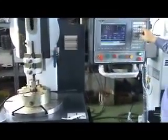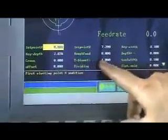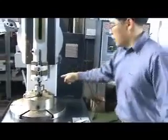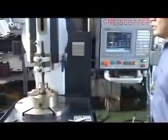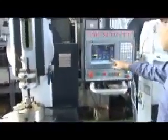Then, okay, we check first point, okay, keyway tip, okay. Or tool direction. For the tool direction, we have a tool this way, it's one. Now the tool cutting this way, 1, 2, 3, 4. You can have four selections for the tool direction. But usually the standard and maker suggestion, one is the standard. This is better for machine running. So one is okay. So everything is okay.